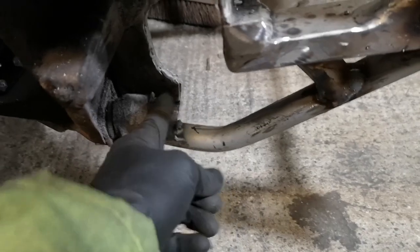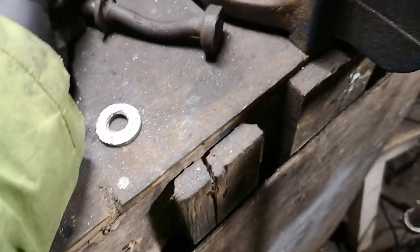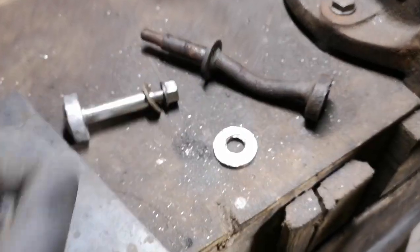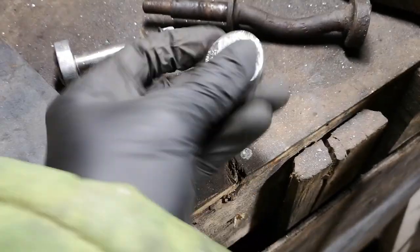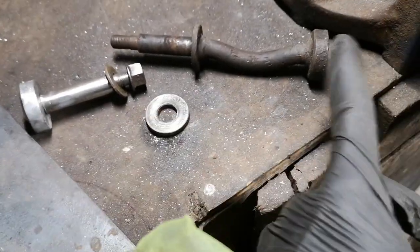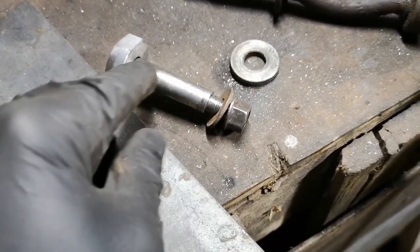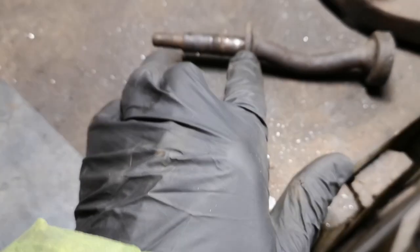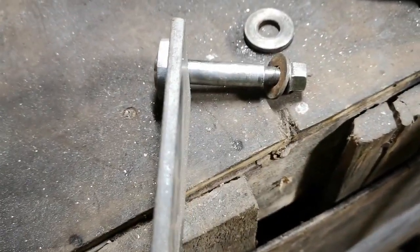So I came up with a plan — I'm still going to put a plate there and probably support the top, which is made out of six mil steel. The original pin looks something like this, a bit of a fangled old thing, a bit random. It allows for a little bit more bracing going further out, but besides the point. The plan was to shorten this: first I took this ring off — it's just welded on here. We then straightened the pin out as best we could, and then I took the end slot off, which has a flat piece. This is the crucial piece I wanted, and then we measured the distance between the original gap for the bush, plus six mil for the steel, and that gives us the pin.